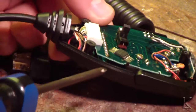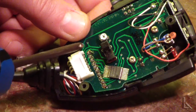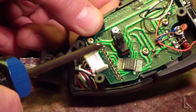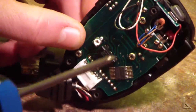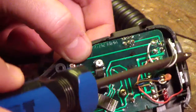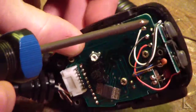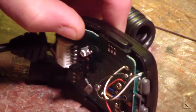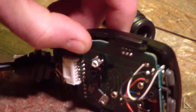It is sandwiched to this board, and you see these solder points across the back? This is a set of pin headers — there are pins that stick up from the bottom board that are soldered to this board, so all of those have to be desoldered. Up here at the top, right under these two wires, there are two more pin headers — another set of pins up in there.